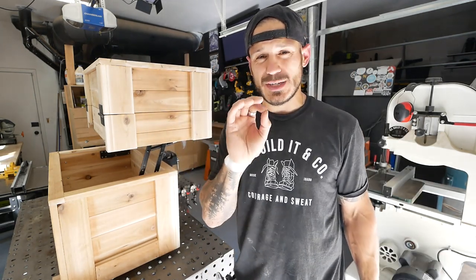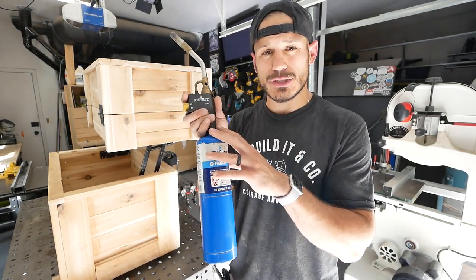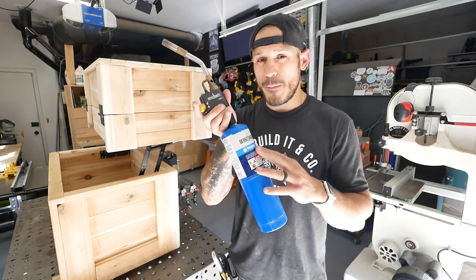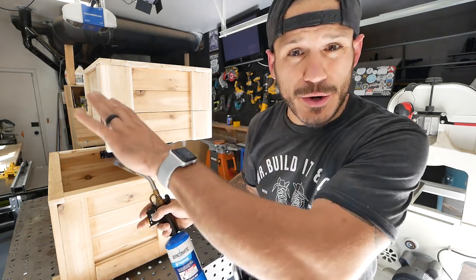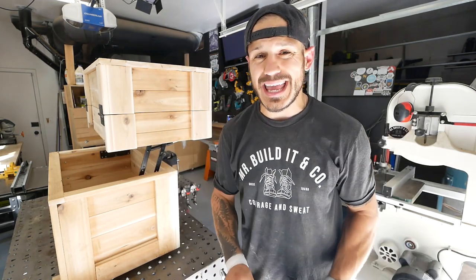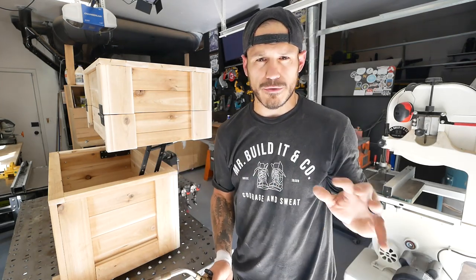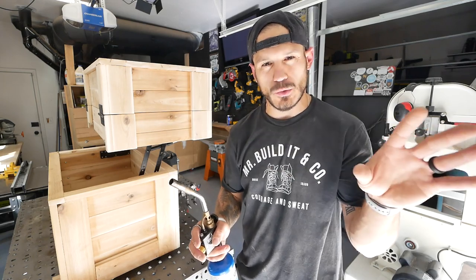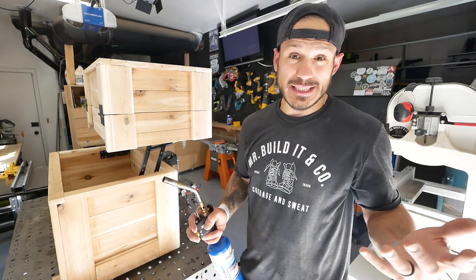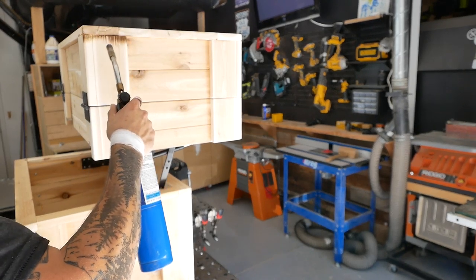To prepare this for outside elements, we're going to use the Japanese wood-preserving technique called shou sugi ban. We're going to take our TS-8000 torch with Bernzomatic propane gas, set the dial, adjust the flame to be nice and controlled, and start burning it following the grain pattern as much as we can. If you want to save money and go with a cheaper wood like Douglas fir or pine, you totally can - just give it a nice cool brown look. Let's get burning!